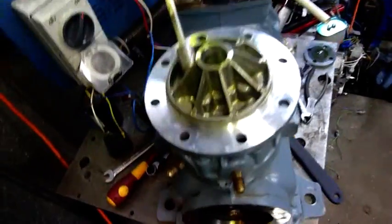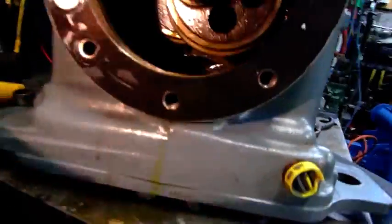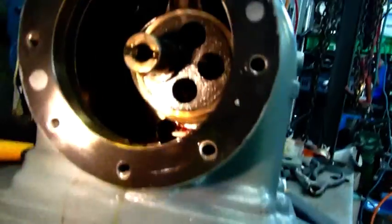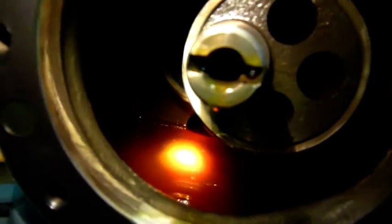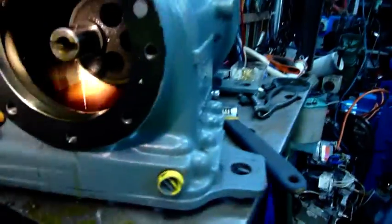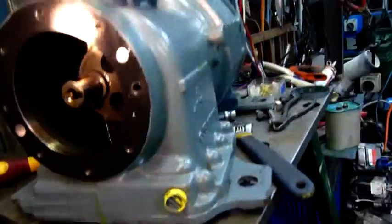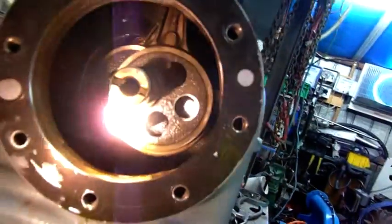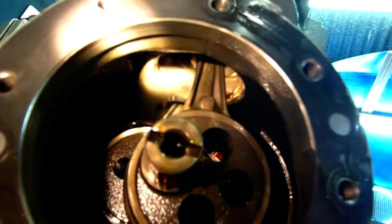I took the oil pump end housing off to work out which way it was running and whether the oil pump would work — and apparently it's actually bi-directional. The stator pack looks good, I can see the windings from here and they're not burnt, they tested up fine. Still plenty of oil in it although it looks pretty evil — had a hard life. The big end wear is fine, they're not sloppy, no metallic particles in the bottom, no metallic sludge — this thing is serviceable, there's nothing wrong with it. You can still see the honing marks in the bores — it's in really good condition.